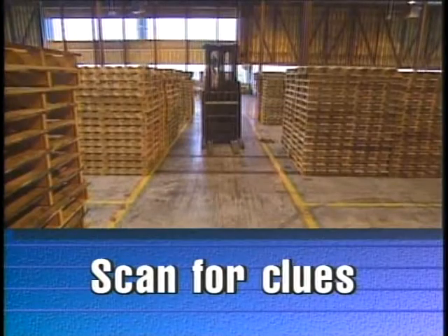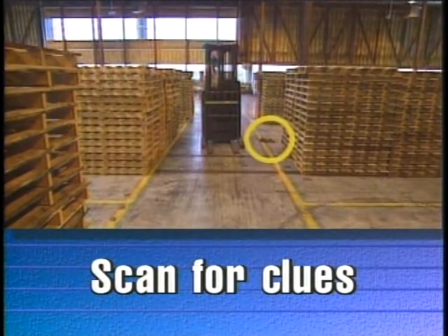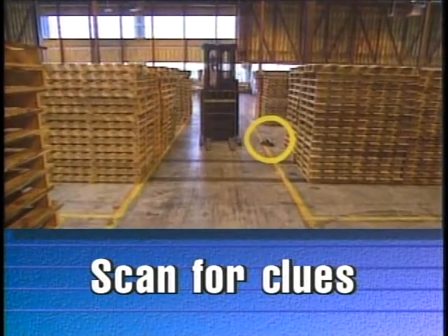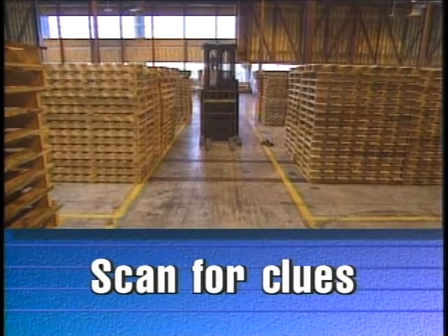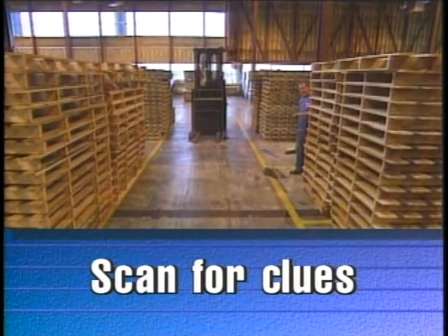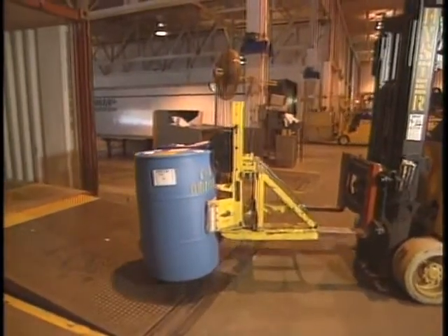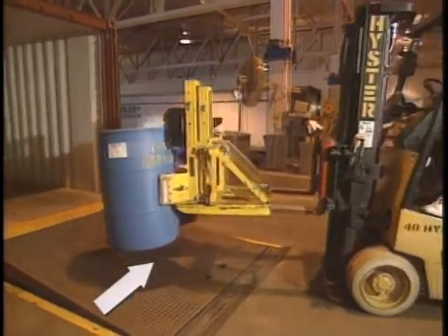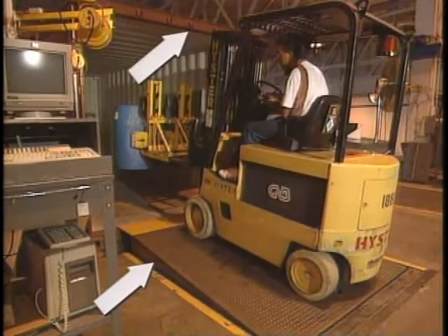As you are scanning, get in the habit of looking for clues. For example, you first spot a pile of rubbish, then you see the broom. Now you know that there is a maintenance worker who might walk out in front of you, and you slow down to be ready. Sure enough, the worker does step out. Your scanning should also pick up fixed objects that may present a problem, such as a dock plate that is slanted up to reach a trailer, speed bumps, railway tracks, uneven surfaces, the roof of a trailer, overhead doorway sills, sprinkler systems, or piping systems. Some of these hazards are well below eye level, and others well above.